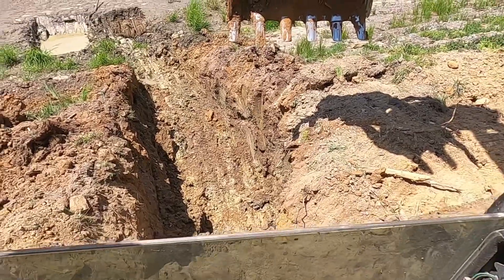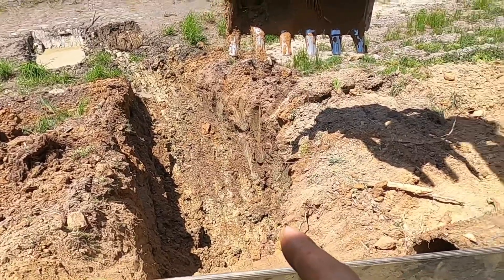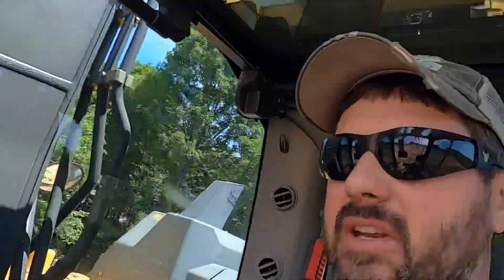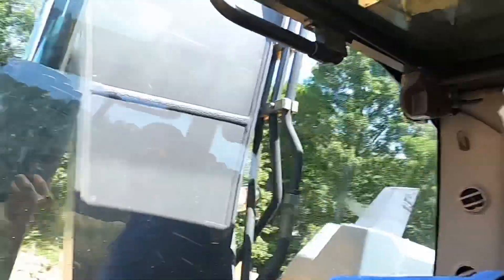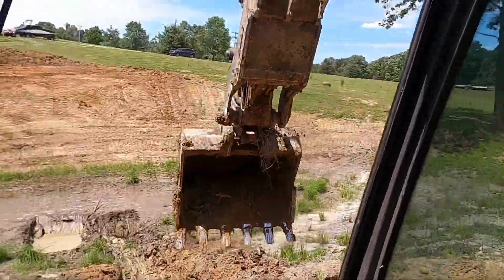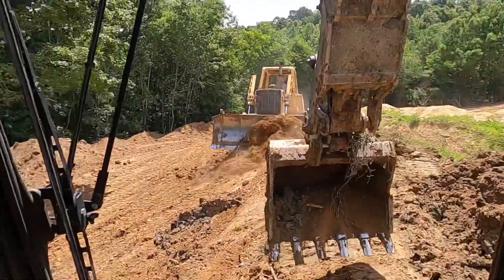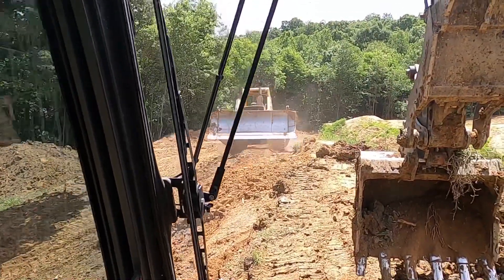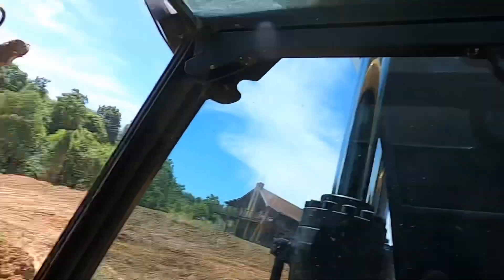I'm not going to hop down in there because I don't trust that hole, but we chased that pipe back probably about 30 feet. We're pretty much in the deepest part of the dam, and I don't see any reason to chase it the rest of the way through. Jerry's over here — he's going to push us out some good clay, some really good dirt. I'm going to take the track hoe bucket and just pack it down in there and cap it off. That should seal her up pretty good. Get that problem fixed and we'll get started on the key way and go the other way. We're getting there.